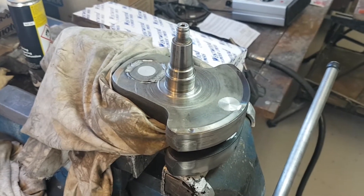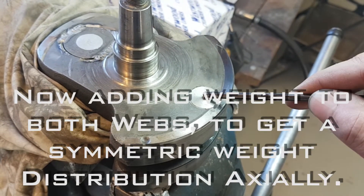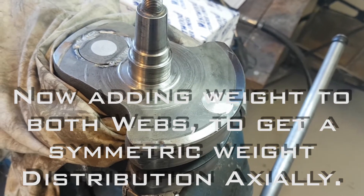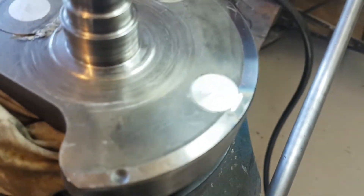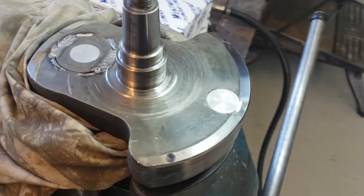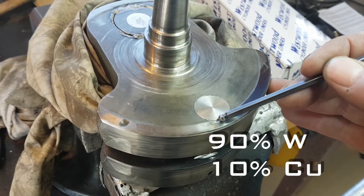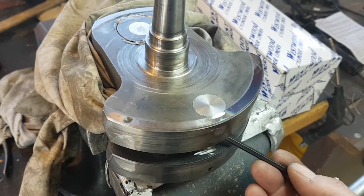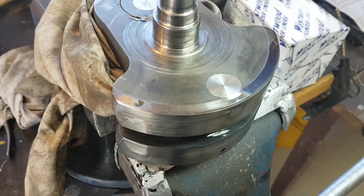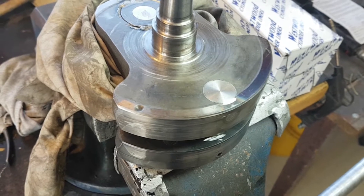So for this season, I have put in some heavy metal inserts — tungsten copper inserts — to get the same counterbalancer ratio. And to secure these in an axial direction, I have ground a little notch here, and also on the inside of the other ones. I will fill that with a little tack weld to make them stay in the axial position.